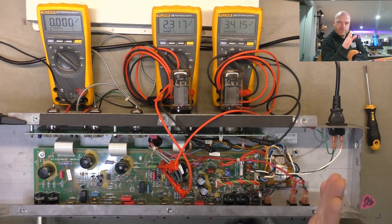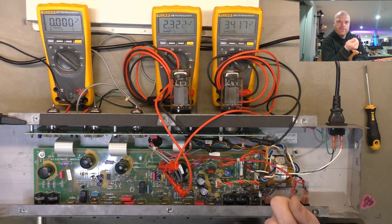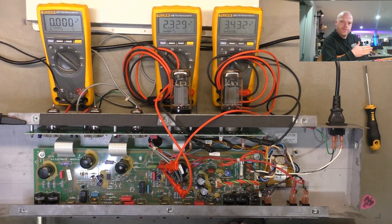I forget which one it is, but if you plug into one of them, it breaks the signal chain. So you can isolate, say you got a lot of hum, just plug a jack into the one that cuts them off. And if the hum stops, you got hum coming from the preamp. If you got no signal and you plugged into the power amp return or the effects return, and you suddenly can hear your guitar, that means the problem's cutting off the signal before that point. If there's still no signal, chances are it's a problem either in the whole amp, the power supply, or in the output stage. There you go. Bill's in the mail for that advice.